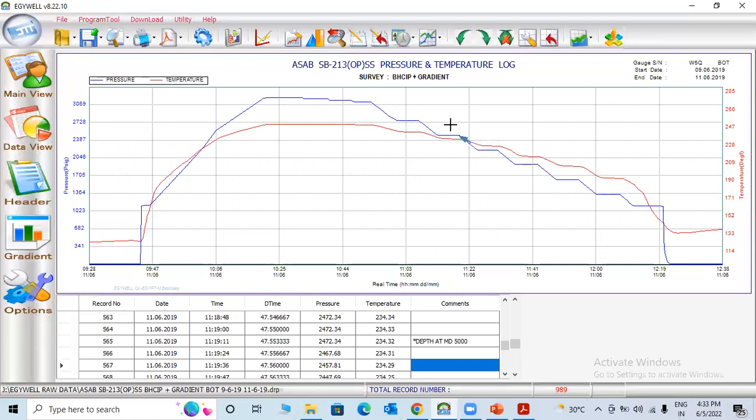know what the pressure is in the GLV, gas lift valve. Before the GLV is changed, they should know how much pressure is inside the valve to equalize the pressure. Before setting the GLV, after setting the GLV, so sometimes 6300, the second, third GLV, 4300, next one 2500. So depending upon the GLV, the depth may change.